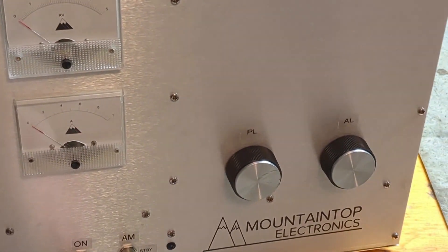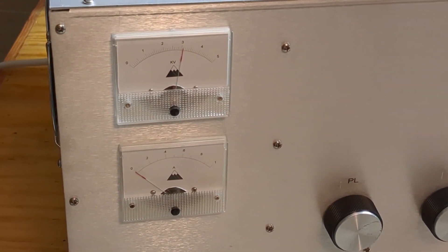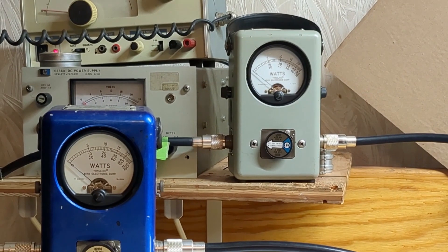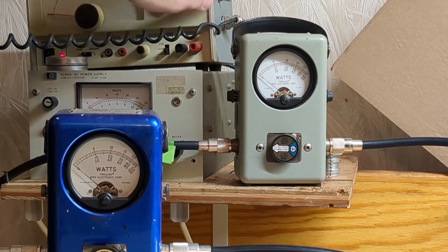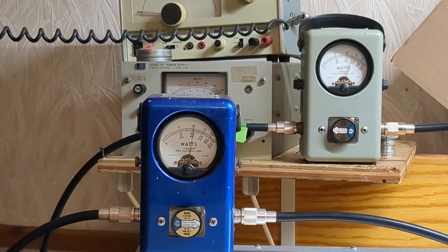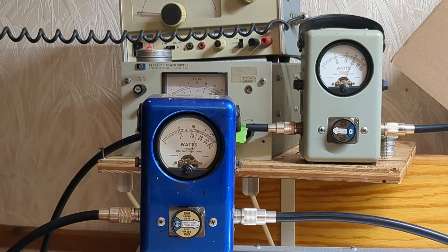Let's put the box on — it has a step start. We're idling around 3100 volts. Put the box into transmit. The box has already been tuned and loaded. Let's pop the tone on at 100 watts PEP — the amplifier is giving us 1300 watts. So 100 watts of drive PEP gets us 1300 watts out, pulling about 300 milliamps plate current. Now let's increase drive to around 130 watts — we're seeing 1500 watts. If we go a little higher to 150 watts, we're seeing 1700 watts.